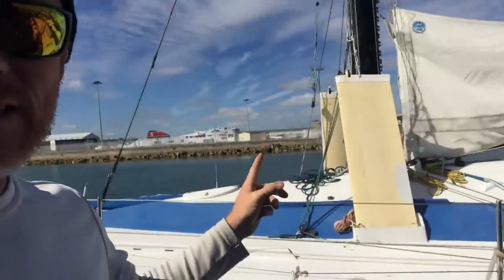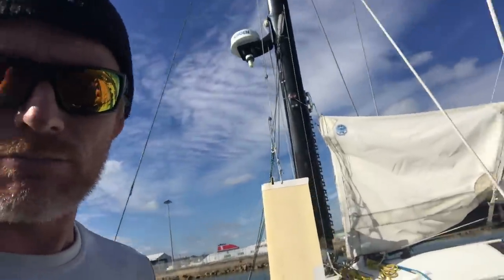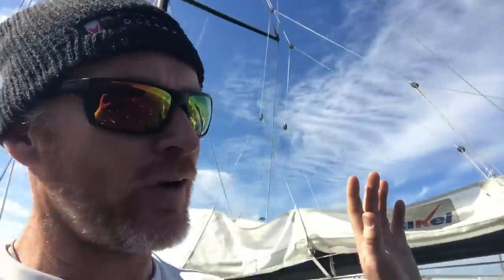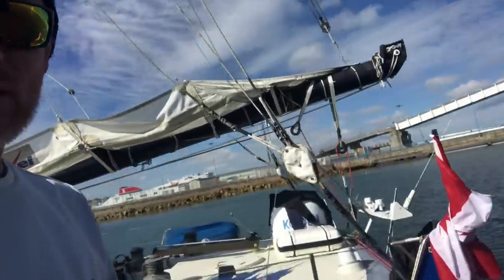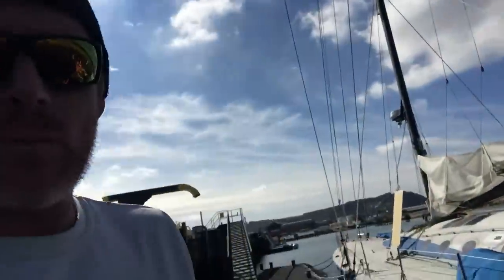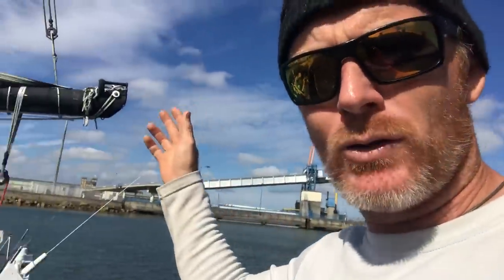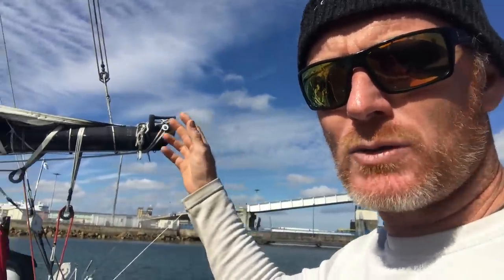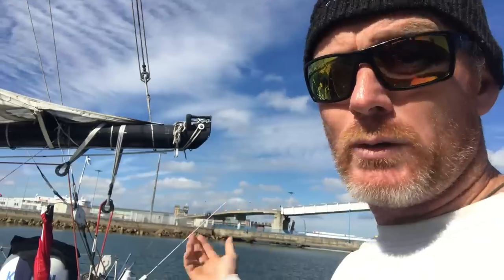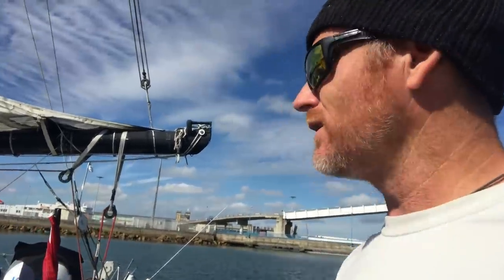This small projection does help the sails — you're not getting sails caught on forestays. But it's another identifier that this boat is highly specialized for going upwind. It's also got a fixed keel, dagger boards, and rudders right at the very back of the boat so there's maximum traction and leverage going upwind. The main boom overhangs the back for maximum boom length — the mainsail is what we use going upwind. This boat is highly optimized.